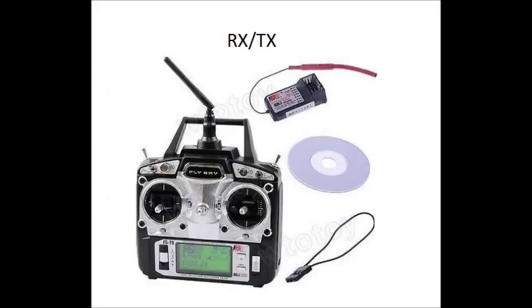With remote control you're going to need a radio and receiver. Generally 2.4 gigahertz is the norm. There are UHF frequencies but those aren't too important unless you're really trying to reach out far for FPV purposes. For line of sight and within about a mile or two, 2.4 gigahertz will cover you for whatever your needs are. I myself use an FST6 — it's a cheap radio, about $60 or so. It's not really the price of the radio that matters; it's the quality and the antennas that is generally the key to success with radio equipment on any medium.